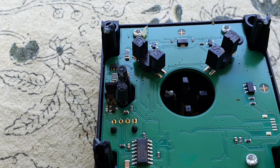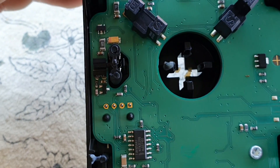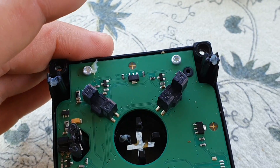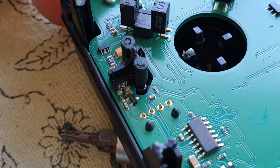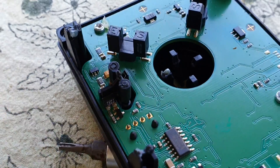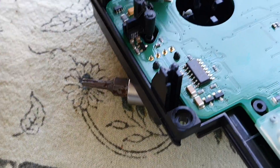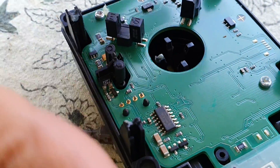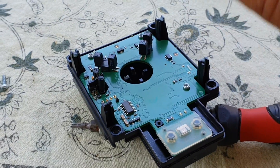It's a diode. Anyway, see that — it's as simple as that! Now I'm going to resolder this and test once again. I'm going to check everything else once more, and after that put everything back and test. The problem was when you push OK it wasn't working all the time, and the turning wheel is associated with this command from the controller — that's probably why.